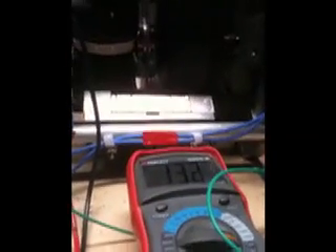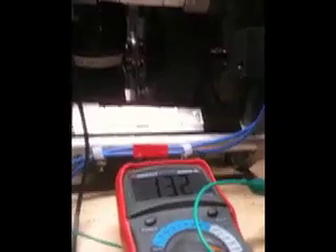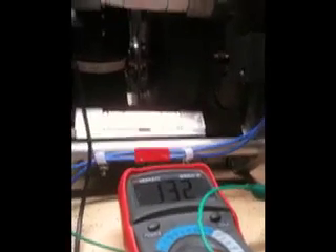That's basically tunable via the capacitor size and where this armature needs to be, so there's just a heck of a lot of testing that needs to be done. But just modestly pushing this machine to about 1,400 RPM with one armature spinning, I've gotten over 310 to 320 volts. I've seen as high as 400 volts just a little bit faster than that — and I'm not spinning it anywhere near the 10,000 RPM I did on my original machine, but I'm definitely getting a lot more voltage out of it. So I just want to give you the initial update for phase one of the testing — there's much, much more to follow. Have a great day.